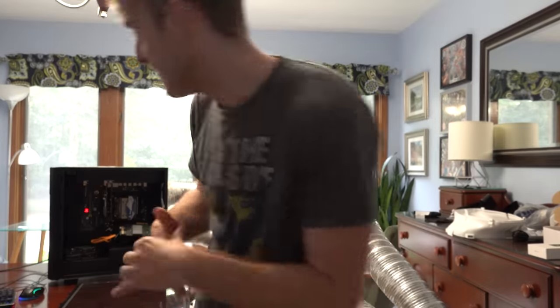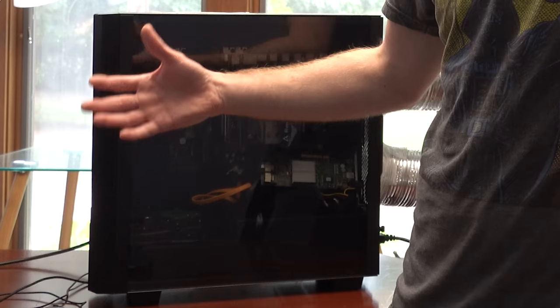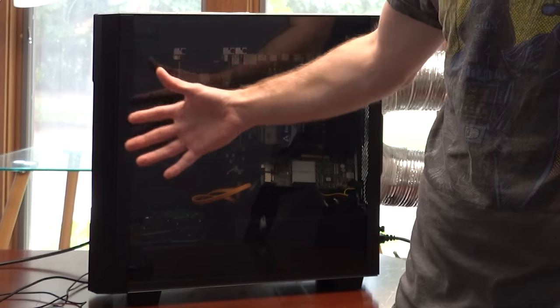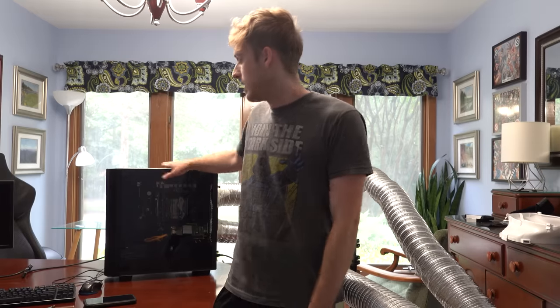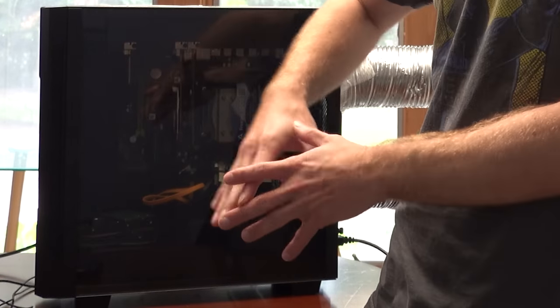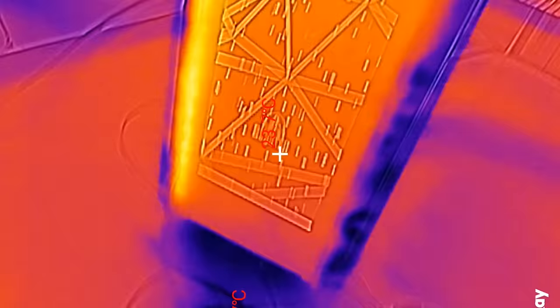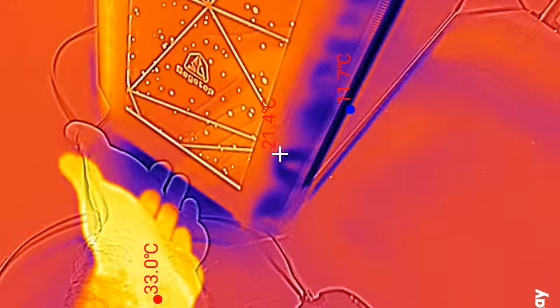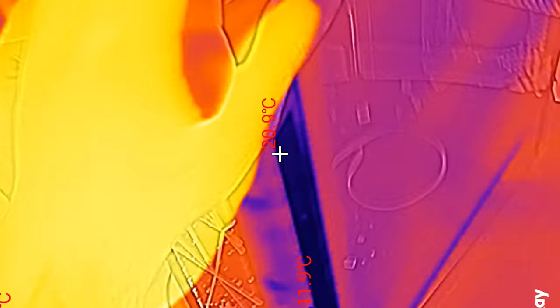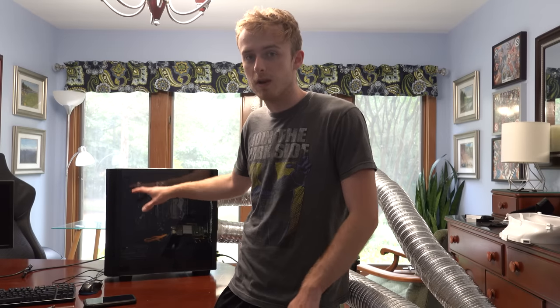Time to put the panel back on. One last thing I wanted to talk about is that the way the setup works — by having only cold air coming in — you don't actually have to worry about condensation on the board. Yes, moisture may condensate on the case itself, but there is high pressure internally blowing all the air out, so there's never an opportunity for water to condensate internally, because you only have cool air coming in and there's no way for hot, humid air to get in anywhere.